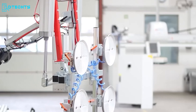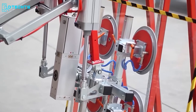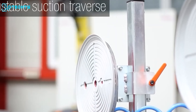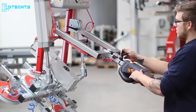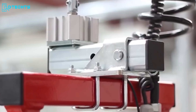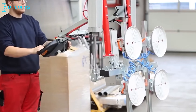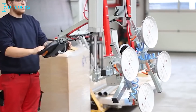Handling large-size glass isn't easy — here comes the Barbaric UniGlass UG4. It's a safe solution for the easy and effort-free manipulation of flat glass, insulating glass, or windows. With different types of suction beams and a compact body, it provides an optimal working area to lift with confidence. It rotates 200 degrees and tilts up to 90 degrees, giving absolute flexibility for unfamiliar shapes. The included safety system never lets your glass go even during incorrect operations, and the blow-off feature allows quick release with smooth, continuous movements.